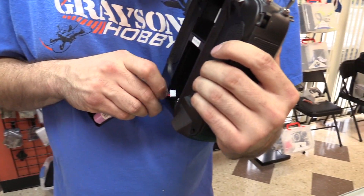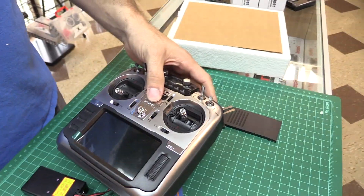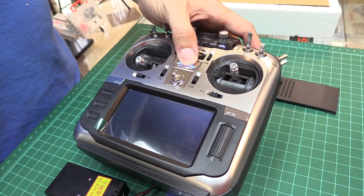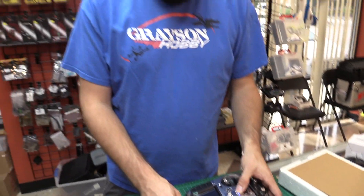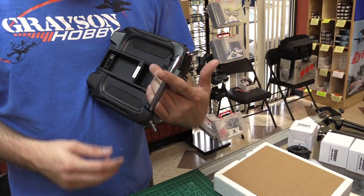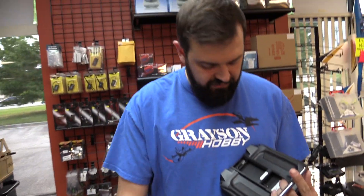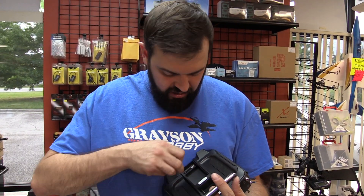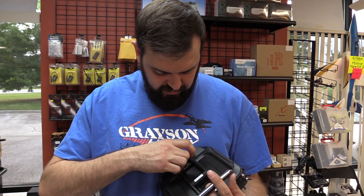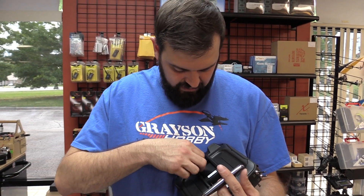I want to check if this radio will boot up without the SD card. The Horus X10, which this is based off of, does not boot without the SD card. So you do actually have to have an SD card in here to use the radio. If you delete your SD card contents, we'll put the link below. I'd highly recommend backing up the SD card contents from the default — that way if you do any firmware updates and screw something up, you can always roll back.